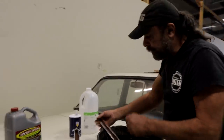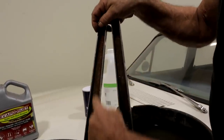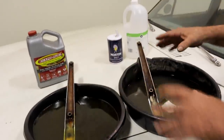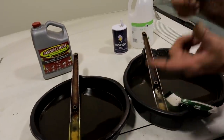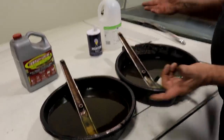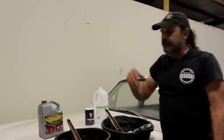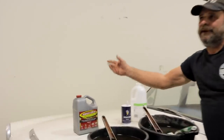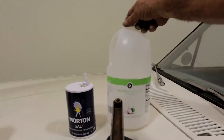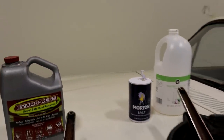Both did a fairly good job, and you can see by the patina on the rest of the strut that these were even going in — pretty much as exact as I could get them. The Evapo-Rust did a better job here, though for some reason it did nothing in the tank. But is it worth the price? This was $31. You can get it cheaper through Amazon, but then there's shipping. The Harbor Freight price was about $29, $31 with tax. And the vinegar is just from any supermarket — I got it at Publix for $2.80, plus probably 20 or 30 cents worth of salt.